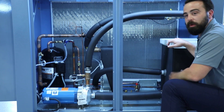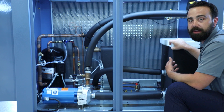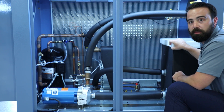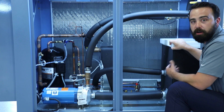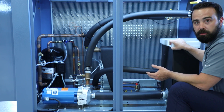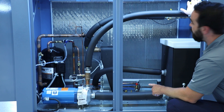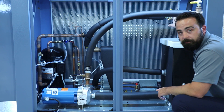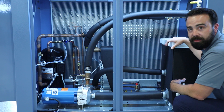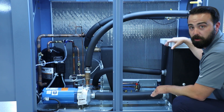Next, we have the poly tank. This poly tank affords volume for the system and allows you to buffer any spikes in load that would increase or decrease the temperature, creating stability. It comes with a low-level sensor, but also has an option for an auto-makeup. One tip: if you're using glycol, you need to be wary of potentially diluting that glycol and freezing your system. Next, we have the manual bypass and the strainer. The strainer is included as standard and protects the evaporator from debris. The manual bypass protects the unit from low-flow or no-flow scenarios that could damage the pump.